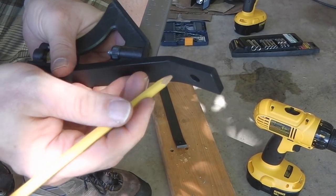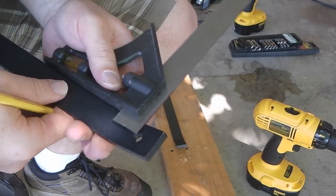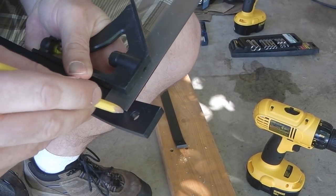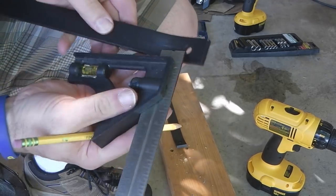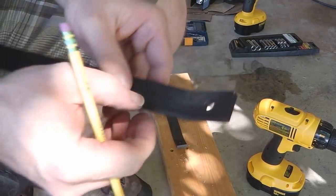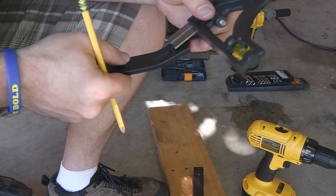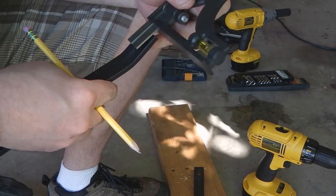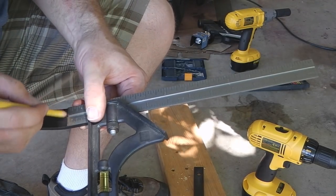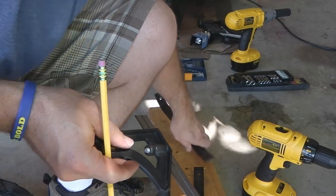Mine's going to be really, really close to the bend — very close to the bend right here where I'm going to cut. So what I've done is taken my speed square and I'm marking a line in the center. That gives me my center line, and you can verify it's centered by flipping it over and seeing that it's still centered. Now I'm going to do the same thing on the other one. The distance in from the end I'm going to go one inch and a quarter off the end. Using the speed square, holding it firm on the end — now I've got my point where I'm going to drill. Do the same thing with the other piece.